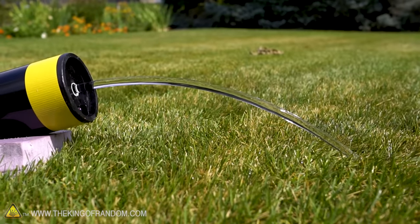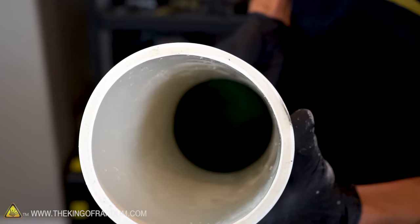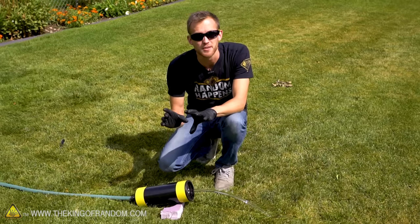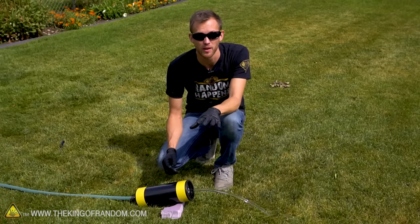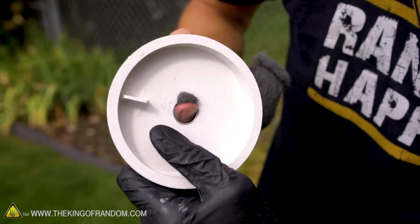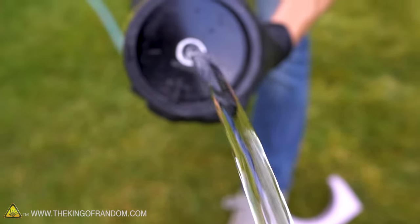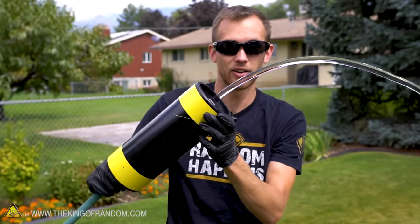A couple of tips if you're troubleshooting your laminar flow device because you're not getting a nice smooth flow. Make sure you have at least two or three sponges at the bottom because they really help slow the water down so the straws can straighten it out. Make sure the straws are all packed in tightly touching the sides of the tube with no gaps. The pieces of screen will help prevent turbulence from building up in the space between the straws and the end of the nozzle. Most importantly, your nozzle has to be extremely smooth — if you can feel even the slightest divot, burr, or scratch in the aluminum nozzle, that's going to affect the water flow. One of the main indicators of good laminar flow is that your water stays together as a cohesive stream all the way to the end. When the water is truly moving with laminar flow, it's amazing how clear it gets.